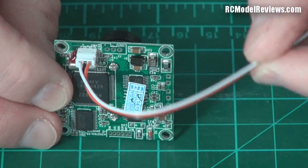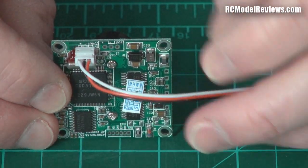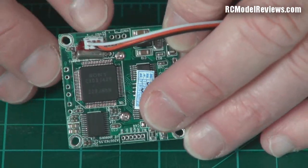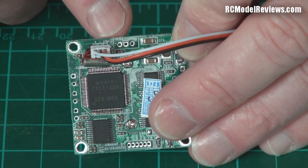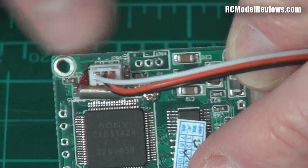It has this loom that's been made up and it's wired up red, white and black — red being positive, black being negative and white being the video signal. But if you look at the board, it has a little legend on it that tells us that the positive is actually going to the video out and the other leads are wrong. It's wired incorrectly still.